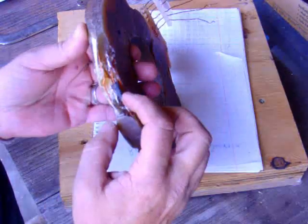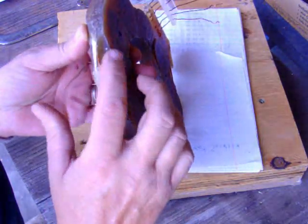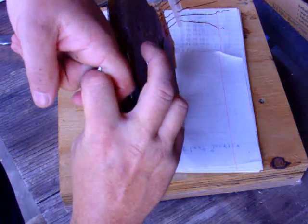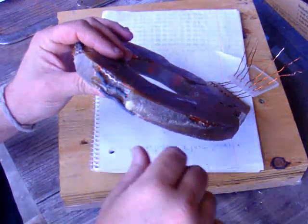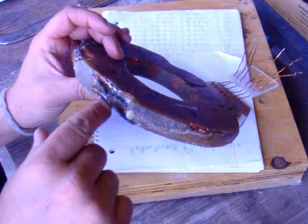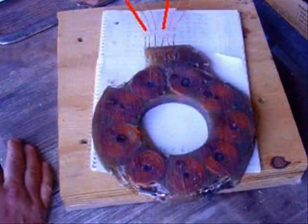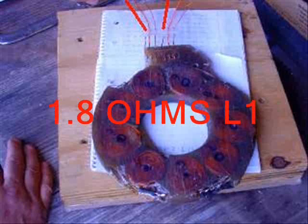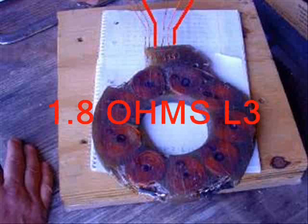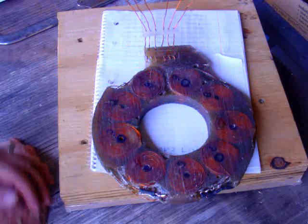This one here did not get hit. The wire was short so I wound up running wire from here to here and then from here to here. I hooked them like this after I cleaned them and soldered the way they make a good connection. These do not connect to each other, and I went through all three of these, so I did the same thing here, here, and here. After I got done and I started doing my ohms, I ohmed out between L1 start and L1 finish and it came up to 1.8 ohms, 1.8 ohms on L2, and from start to finish on L3, 1.8 ohms, which I thought was great.